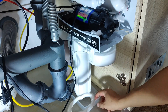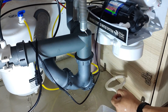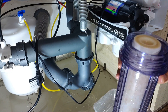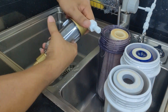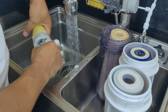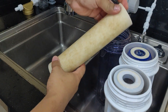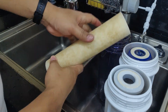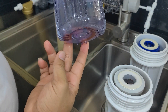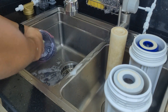Repeat this process on the two remaining filters. Include cleaning if you have a mesh pre-filter. Clean all filter housings with antibacterial dishwashing soap solution and rinse thoroughly. As you can see, the sediment filter is already showing some discoloration — this had been in service for six months. Please refer to your manufacturer's maintenance schedule, but the maintenance period may vary or may come earlier depending on the condition of your raw water supply.